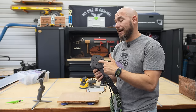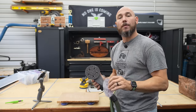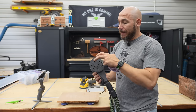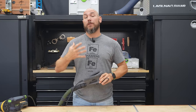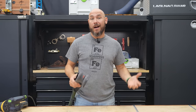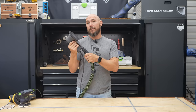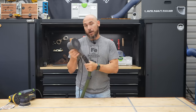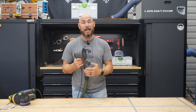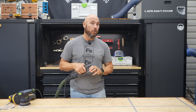The number two purpose these holes provide is to keep the tool and your sandpaper cool. Keeping the sandpaper cooler will help it last longer, and keeping the tool cooler keeps your hand much more comfortable. Even when you use it for 30, 45 minutes at a time, it just doesn't get hot — barely lukewarm. If you have a dust extractor, it's pulling air through and keeping that tool cool. You should always use this with a dust extractor of some kind, even if it's just your shop vac — it helps pull air through, clean the dust out, and keep your tool cool.